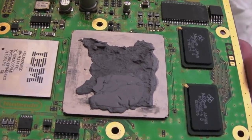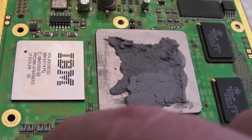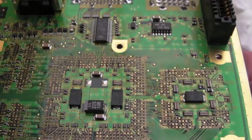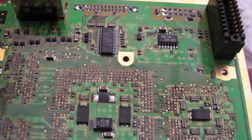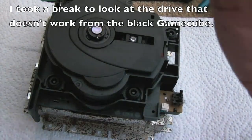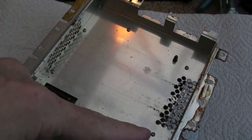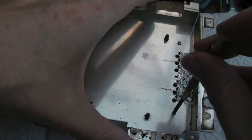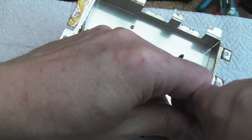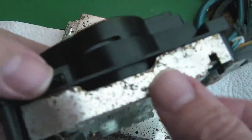We can keep swapping chips on this. I could swap the clock chip, or I might try this — this is the audio RAM, I think. Would that stop it from booting? Well, technically it could, if it does some sort of diagnostics as it's booting it might stop where something's wrong. But I doubt it. I think if you've got an audio fault it would manifest itself as not sounding right or having no sound at all. The other possibility is that little IC there, but I have no idea what they do. On this side, that's the audio amp, and I think that's the video encoder — I don't think either of those would cause it to not boot. So I'm not really getting anywhere fast with that, completely dead board.